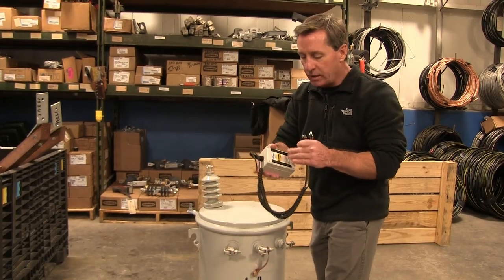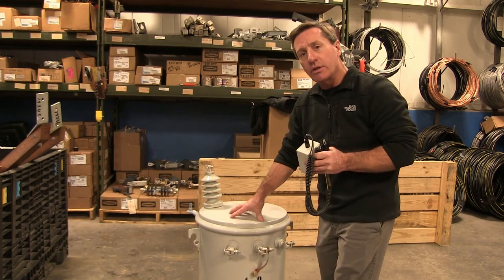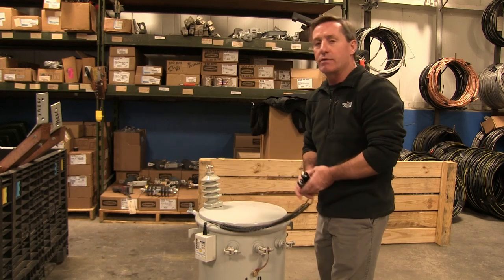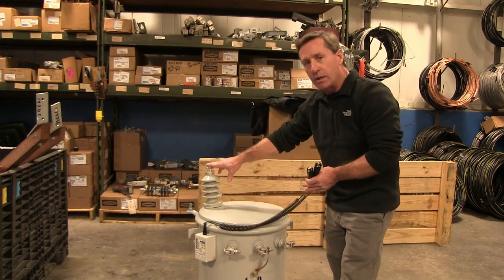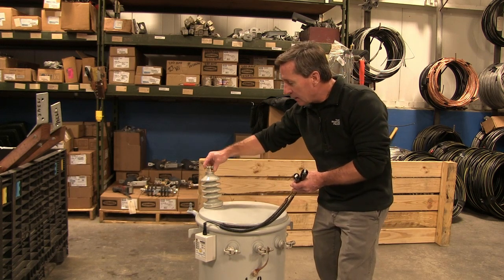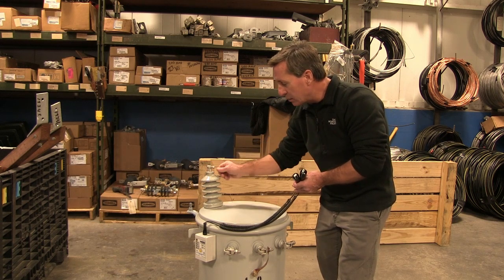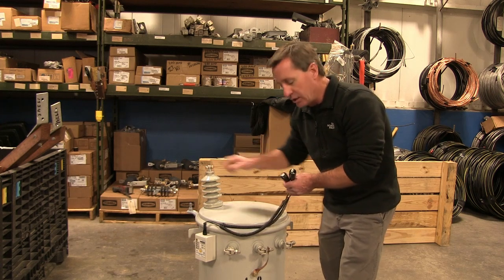On our 6793 there's a magnet in the back. So unless you've got a stainless tank for your transformers, this will hang right on the tank and gives you both hands free to work. When you hook this up to your bushings, make sure it's a good connection. Make sure it's clean and either the lug is tight to go on to the back of the threads or go on to the main part of the bushing — it's got to be a tight, good connection.